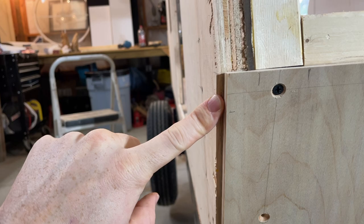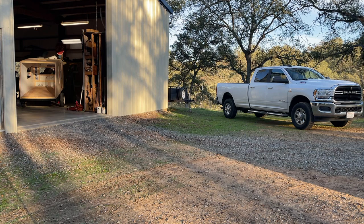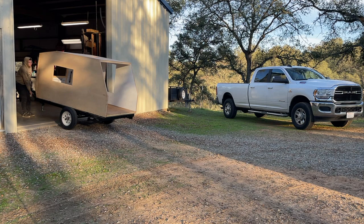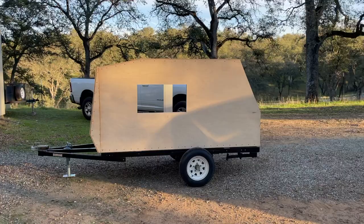The easiest solution to this would be to just build your walls at 4 feet wide, of course, or you could even do slightly less so that you can use the router to trim the edge off and get a super sharp edge. In this case, I started with a plan to have a roundover on the edge and then fill any gap with glue and filler. Since then, I've changed my plan to just filling it in with some wood strips. This would have been easier to do if I had installed the skins flush with one edge of the trailer, so that I only had to install a single wide filler on one side of the trailer, rather than what I'm going to have to do, which is install a thin piece on each side.